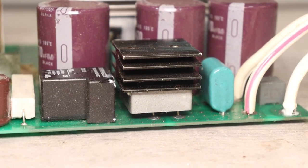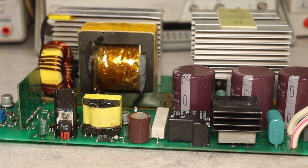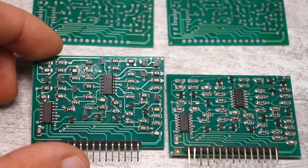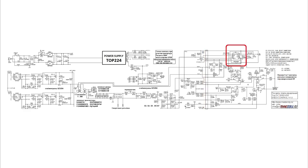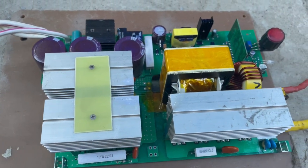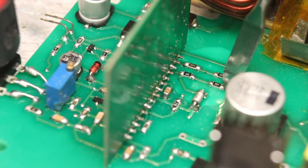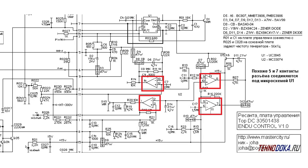Its contacts close and all power goes through the closed relay contacts. Further, according to the classes of the genre, we have a powerful rectifier bridge and smoothing power capacitors. Rectified and smooth power is supplied to a power inverter built on IGBT. The control system consists of a PWM controller and other things according to the circuit. A single-ended PWM for the UC family is used here. The drive of transistors is organized through an optodriver. It is worth noting that the inverter has protection against low mains voltage — the control system probes mains through a resistive divider and if everything is fine, it gives a permissive signal to the PWM. This and other monitoring options are handled by a 4-channel operational amplifier.